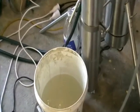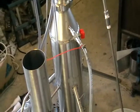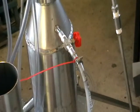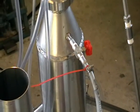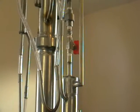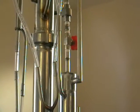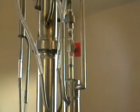Here is the water. Controlling the still means you have to find an equilibrium between the power supply to the still and the ratio between the spirit supply and reflux ratio. This is the valve you're controlling everything with. Once you've found the perfect ratio, it's better to leave it like this and not touch anything.